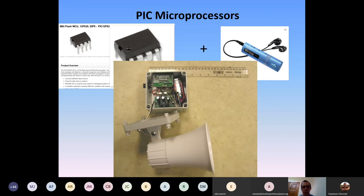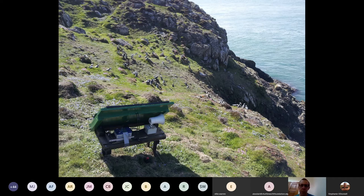A lot of our work has involved PIC processors — basic 8-bit or 16-bit PICs. We've used MP3 players and built what is probably my most direct conservation impact project: an MP3 player, an amplifier, a PIC with a timer turning it on and off. We deployed this in remote places with a solar panel, backup battery, horn speaker, and decoy puffins. After an eradication — removing rats, mice, whatever — you switch your caller on and the birds come back and start breeding. The whole setup cost about £50.